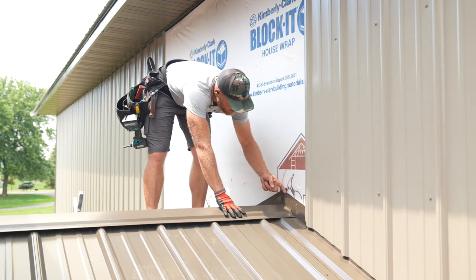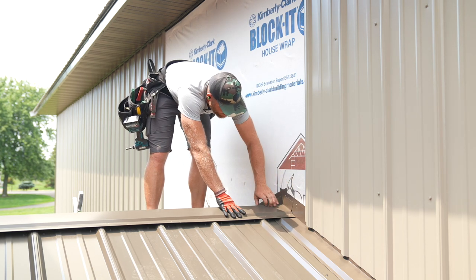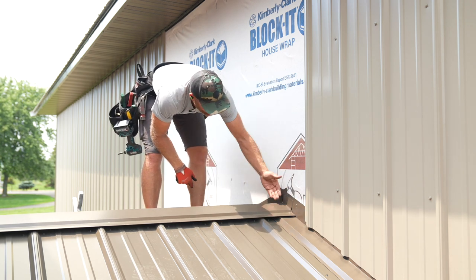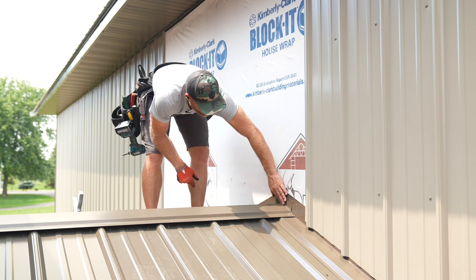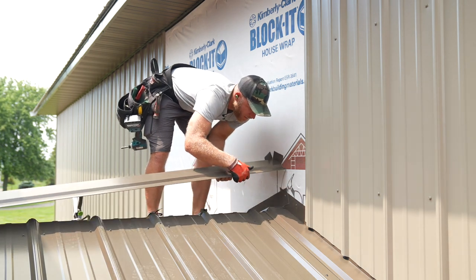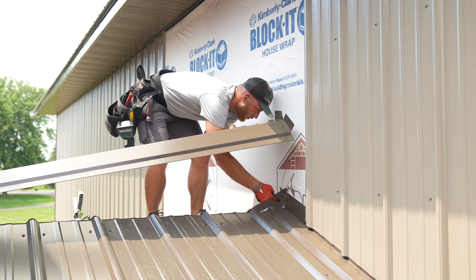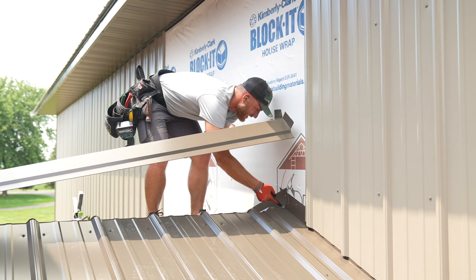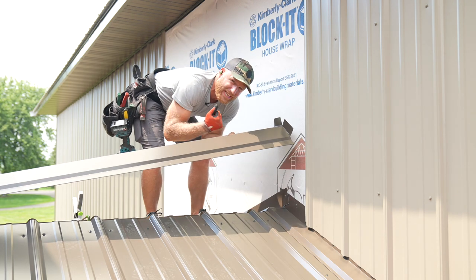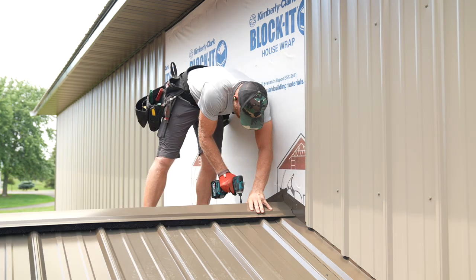I did all the mechanical flashing I could back here. I did this little bit of a bend up here. You still have this point. I'm gonna hit it with some silicone. The metal is gonna go over. I've got a rib landing right here. That's gonna pop it out. So water's not gonna really be able to get here. Let's assume that it does get behind this point right here. And at that point, it gets down here, you know, unless it wicks its way into this little gap right here that is siliconed, it's gonna go over, down. There's not gonna be anything drawing it in to this peak. It's just gonna naturally fall down and go out the roof.